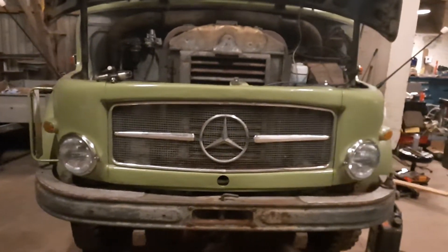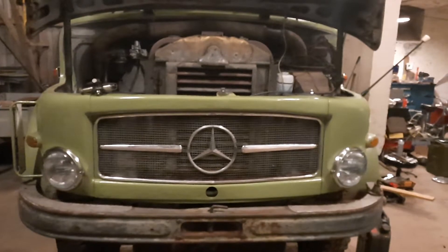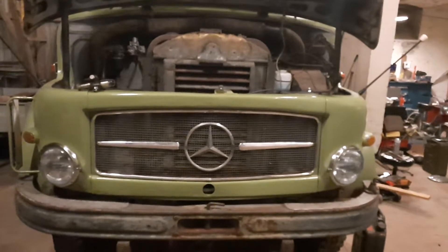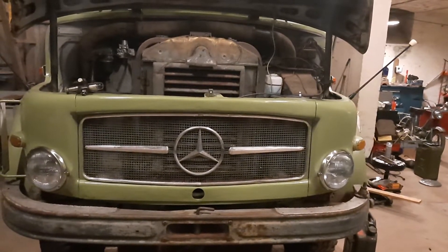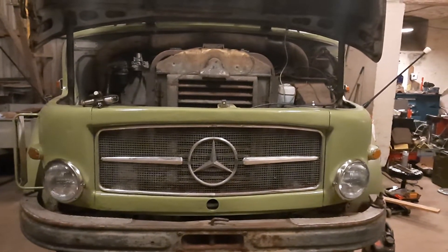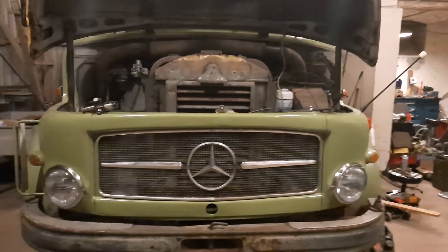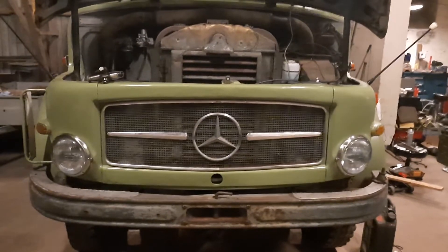1964, functional of course, but it would not start, and I couldn't figure out why. It did as it used to, but all of a sudden it just smoked a whole bunch and just wouldn't start. I started wondering that perhaps the fuel pump itself would be faulty, given that today's diesel fuel is now mixed with biofuel — B5 or B30 or something like that. And that changes the bacteria in the diesel, which means it will actually eat up more gaskets and rubber if it's not meant for biofuel. I got concerned, and unfortunately my concern was spot on.